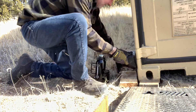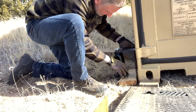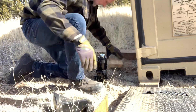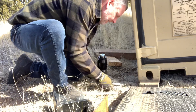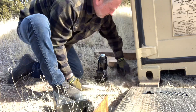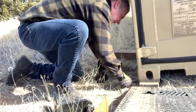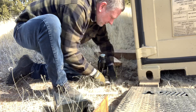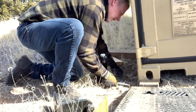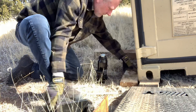We're just talking about a Husky 12-ton jack — you can go with a bigger jack, but the problem is clearance issues. See how we're not clearing now? So I have to pull this out and dig this up a little bit, or get some thinner wood, or go without the wood. If you try to do this without the wood, it will definitely sink into the ground to the point where your cargo or shipping container could tip over or fall off the jack. If you like your toes, this is not a good thing. So lay a platform down and keep it nice and clean.